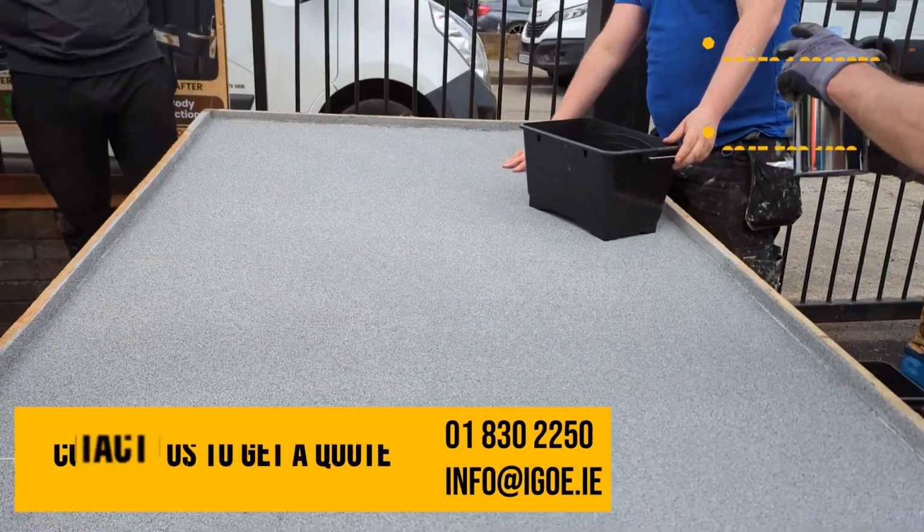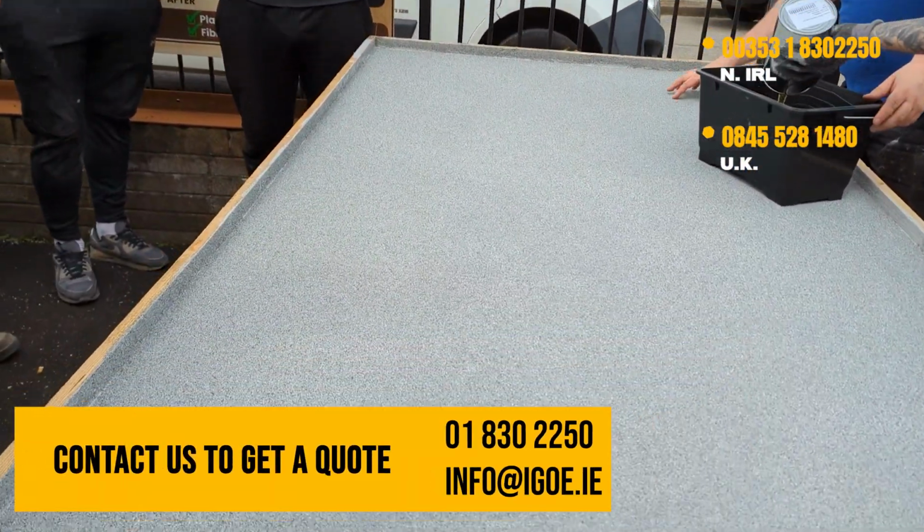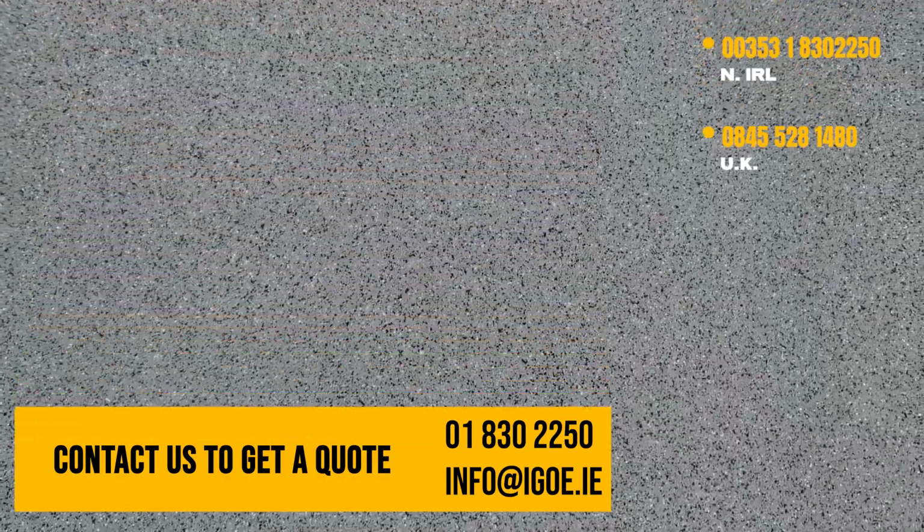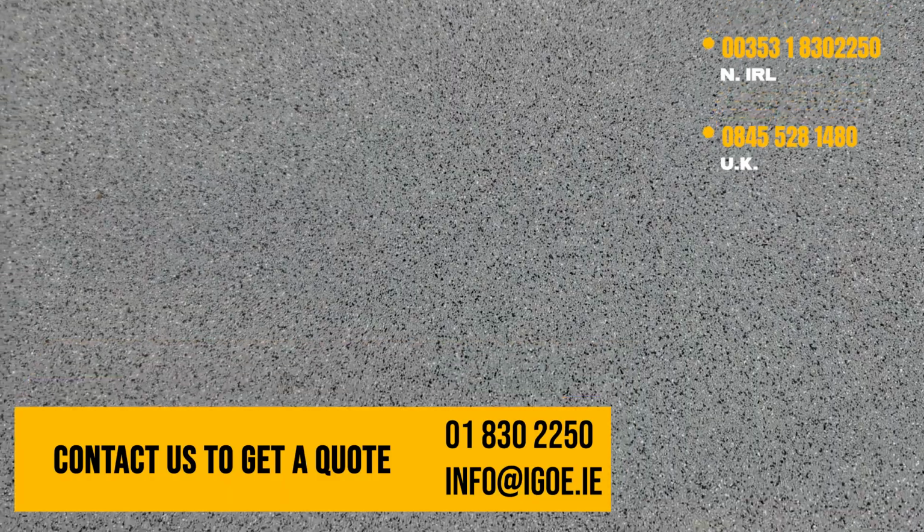Clear top coat was applied, and then another layer of clear top coat is going to be applied to it now. So underneath that will have its 2.5 mil of Lava, and then your quartz sitting on top.